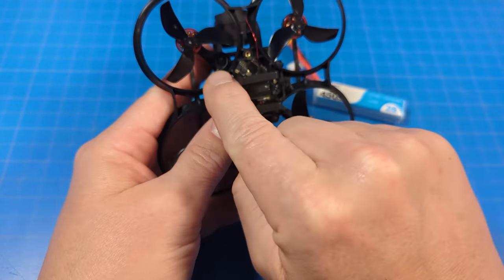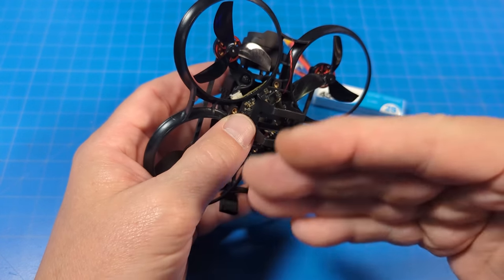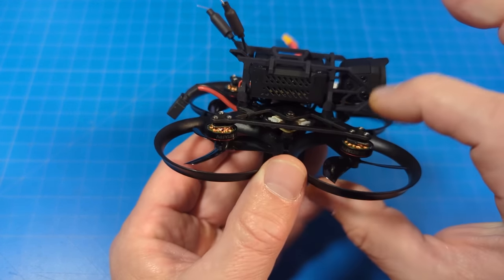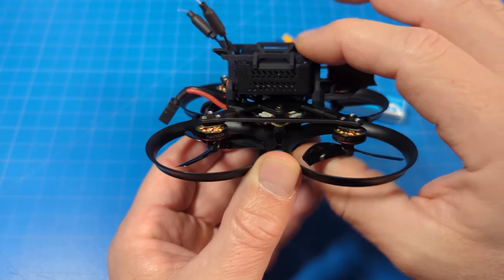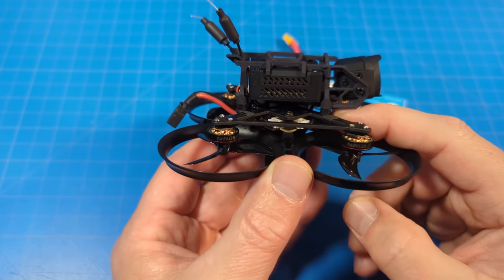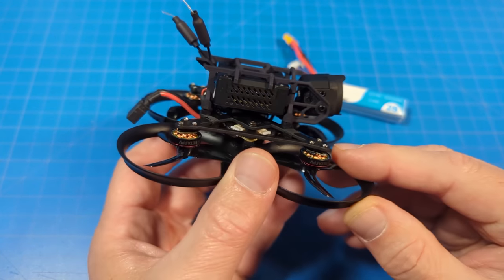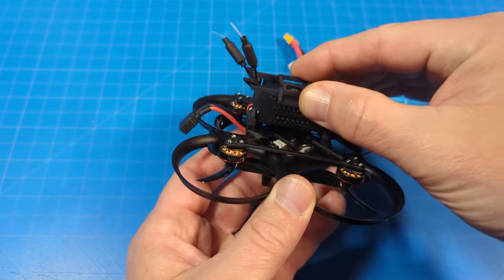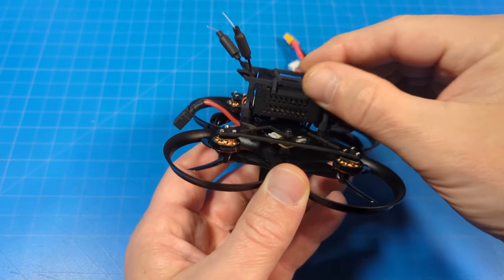This top cage screws in through the screws you can see right here — they are pointed screws, so there's no fitting inside the print. It's just a typical screw holding the two things together. That's a point where you need to make sure you don't get it so tight that any vibration dampening you might get from the rubber grommets ends up transferring vibrations into your video. You want to get it snug against the grommets but still allow it to possibly bounce around. I say that in speculation — I didn't test how much video vibration you'd get with the screws too tight. But if you make your own and cut your own carbon and go this route, that vibration dampening needs to just be touching so it can't jiggle freely, but you also need to have that vibration dampening working.